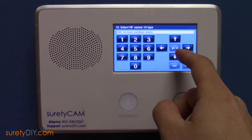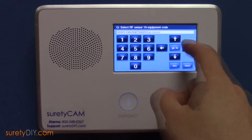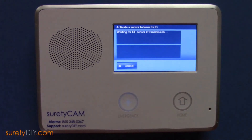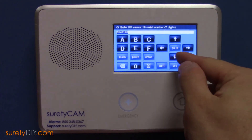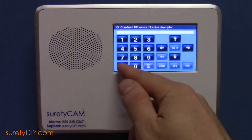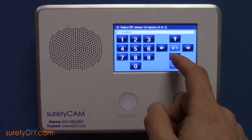First, for the flood zone, for the sensor type, select 24-hour auxiliary alarm. Equipment type should be Water and then choose Existing Flood Temperature Sensor. Press Shift and Learn and tamper the sensor to learn in the serial number. Select Loop 2 and add a voice descriptor. Finally, select the desired chime.